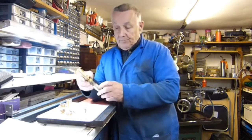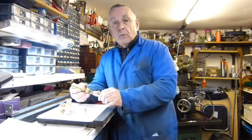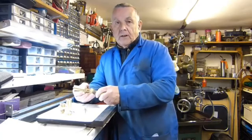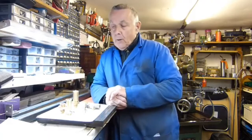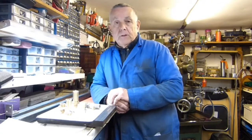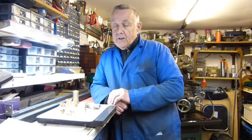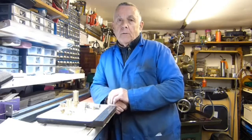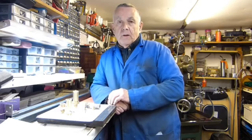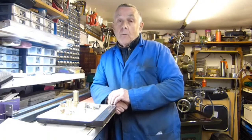These are nice safety valves, and if they're done right they work a treat. The previous safety valves I had on my previous Romulus worked without any trouble — no bother at all — for a few years without touching them. They really did blow off suddenly and then drop suddenly, and you lost very few pounds of pressure. They're very interesting to make and just a bit unusual. I hope you found that interesting, and thanks for watching.